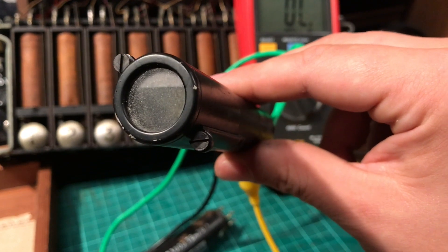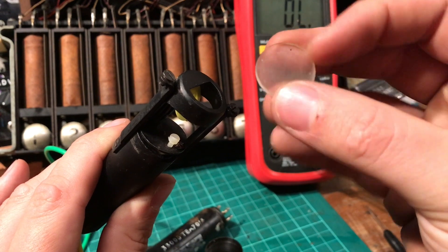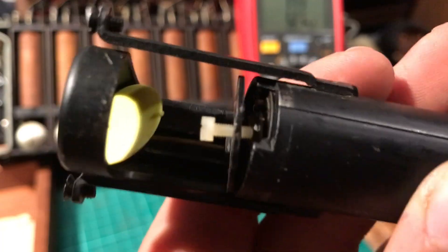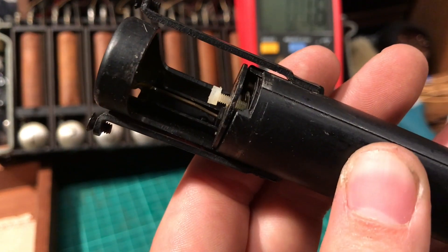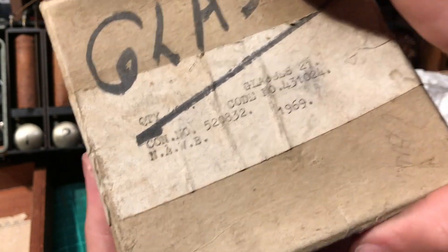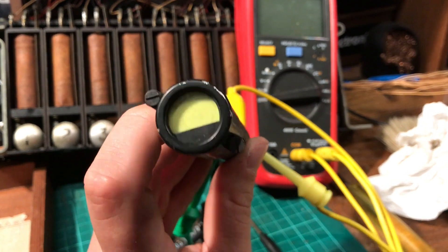We've got another one hooked up - let's see if this one works. Pretty good, but not working on the little switched contacts. I need to open it up and adjust that screw. There's a bit of a dirty lens - I do actually have some spares, so we might swap that one over. I'm going to turn the power on and see if it pushes down the switch - no, not quite enough. So we're going to put that screw in, do that through the front, just screw in a few more times, and turn the power on. There we go, working perfect. Also give it a little dust and clean while we've got it open. In a box dated 1969 we've got some spare glasses. Let's put that in there - that goes on top and gets held down by the cover. There you go, a fully working clean unit.